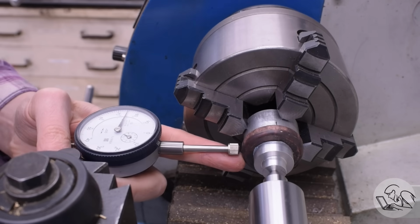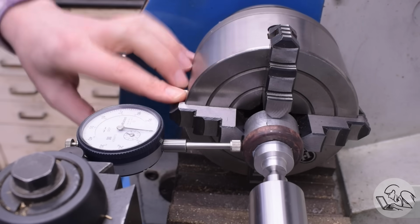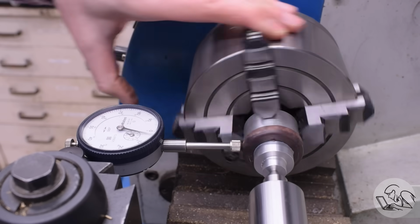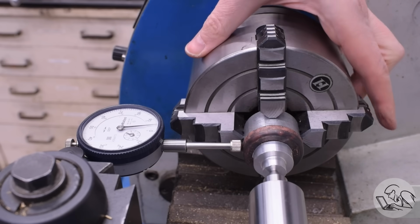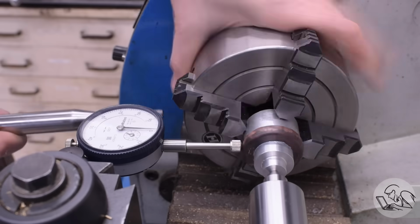Now I'm going to dial in the copper itself, not the mandrel, because I don't actually care if the flange is concentric with whatever the spinning axis of the copper is. What I care about is removing roughly an even amount of material all the way around. If I try to make it concentric, I might end up making some area too thin.